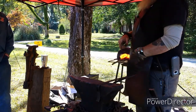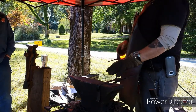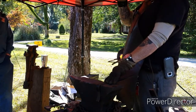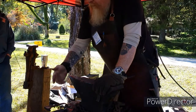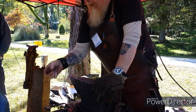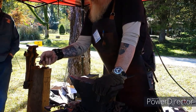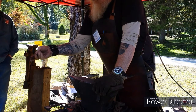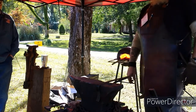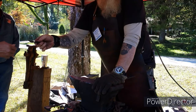Then I'll turn it over and use the cross peen. Drop the sides of the leaf to make a broader leaf. Then I'll thin that center out a little bit more. You've got to put a groove. Well, yeah, I can either do the little groove or do it like this one, where if you'll notice the center's a little bit more pronounced. I use the cross peen at a slight angle to texture off each side. It gives kind of the illusion of texturing on a leaf.